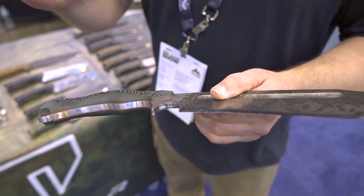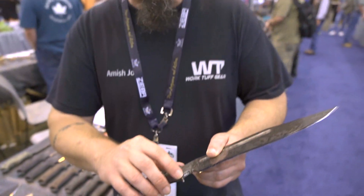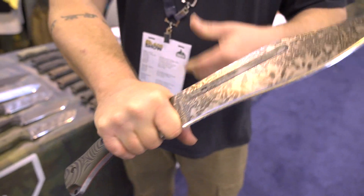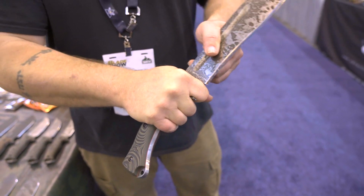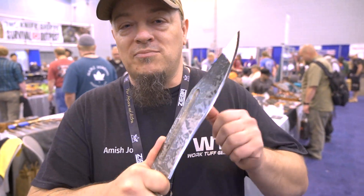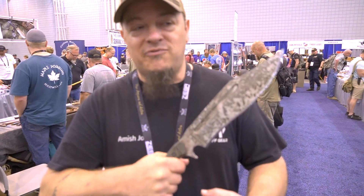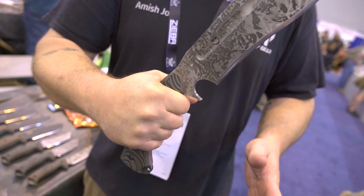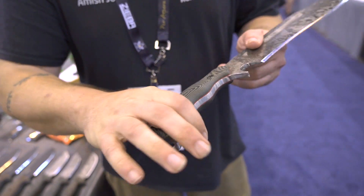The choil — we're gonna make it less deep, more shallow. We're gonna add about two millimeters of material there to give more room for larger hands. For my hands it's fine, but for larger hands it might feel a little emptiness there. When I use large knives, I'm mostly working with the choil — this grip is my predominant grip. My secondary grip is when I'm chopping, and then my last priority is sadly how everyone holds a knife when they first pick it up.